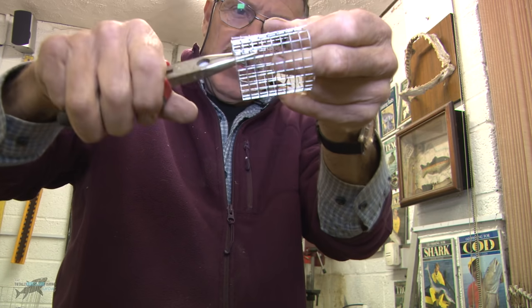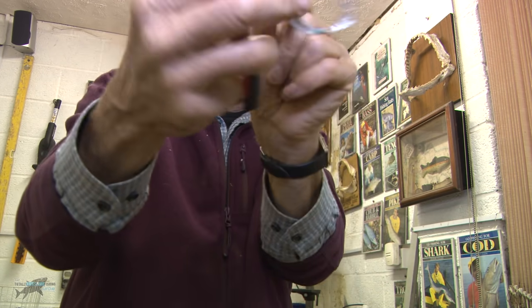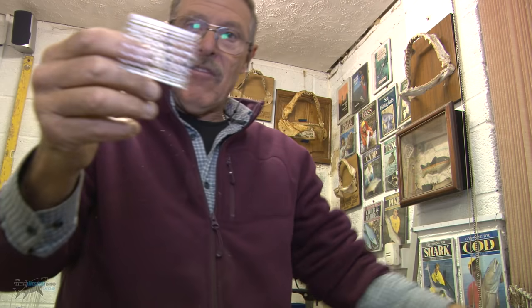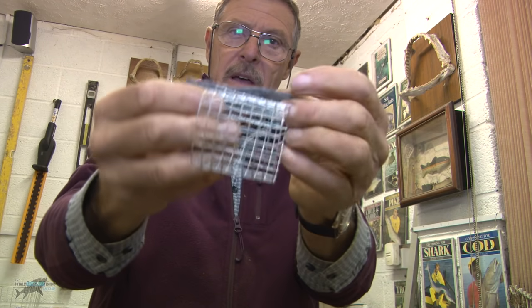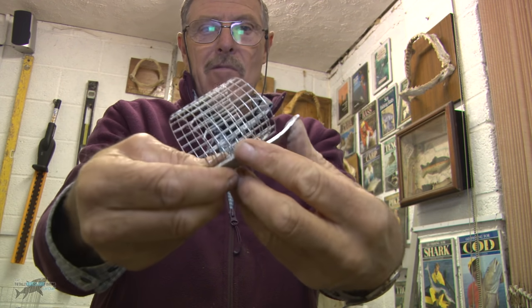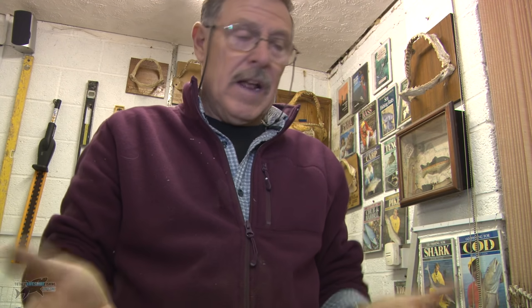And of course, the other thing I'm going to do is you're left with this tag end here, a little bit sticking up there. But what I'm going to do, my lead strip, my weight of whatever I'm going to use, in which case I'm going to use my lead flashing, if you can imagine, I'm going to cut my strip up. It's going to go over that tag end there and fold around in here. So let's cut a strip of lead up. You've got to guess this, unless you want to cut your strips of lead up and actually make it to the required weight you think you want.